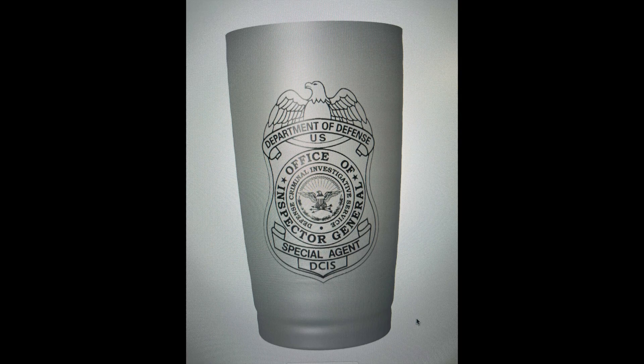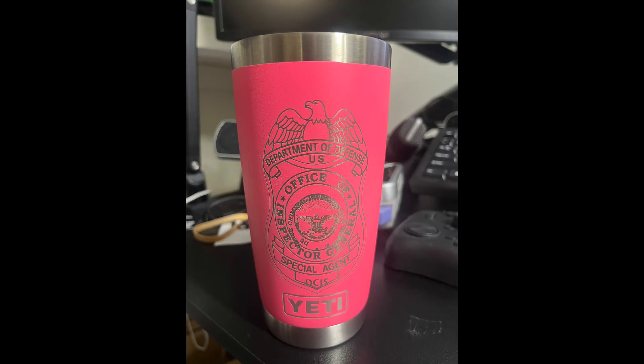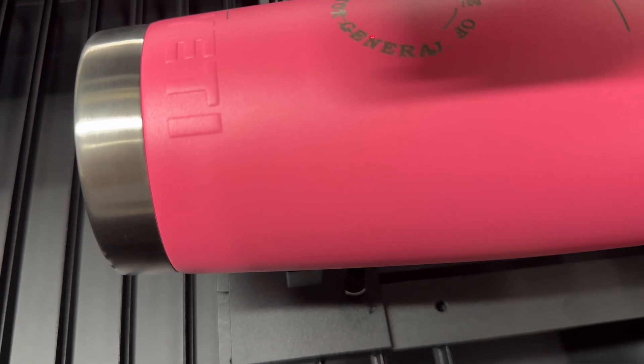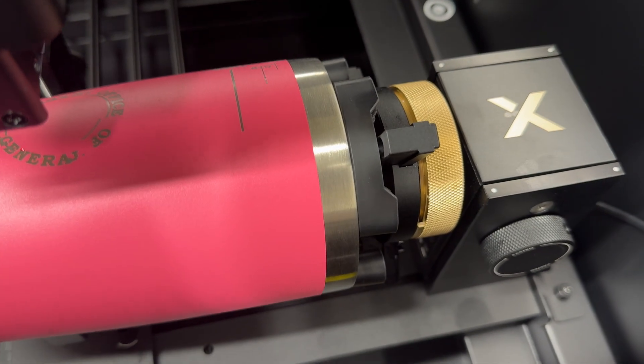Unfortunately we had a total failure. There seems to be a problem with xTool Studio. The 3D model looked perfect, but in the finished engraving the middle and bottom text dropped to the wrong spots — everything went down. Someone suggested the rotator shifted, but I saw no shifting. To be sure, I checked again today, did another engraving, and it wasn't even five minutes in before it was completely off and shifted to the wrong spot. This is clearly not a slippage issue — it is perfectly mounted.